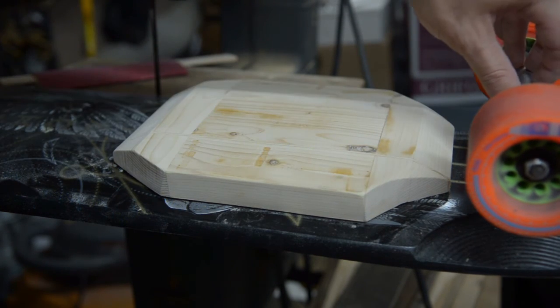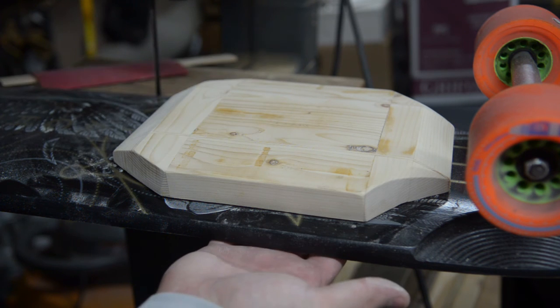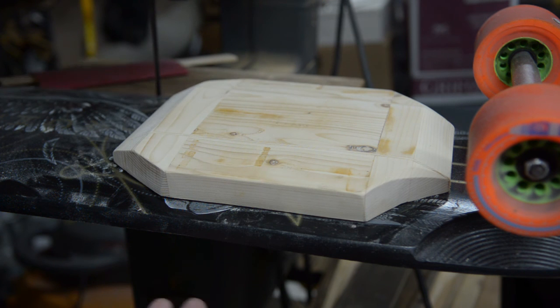Now I'm going to take the trucks off, then I'll have space to build a press. I'm going to press those down with some foam and wood, sandwich the hot plastic in between there around the buck, and hopefully it will form up nicely.